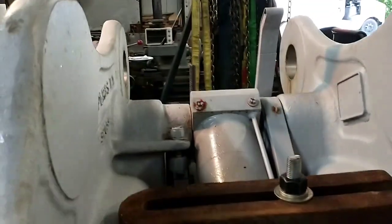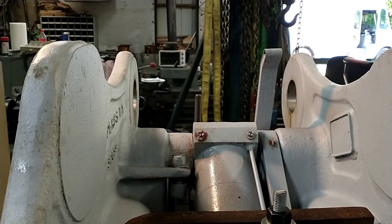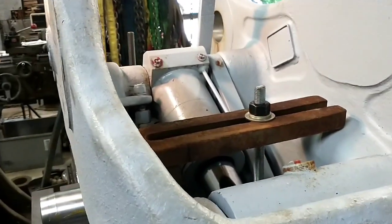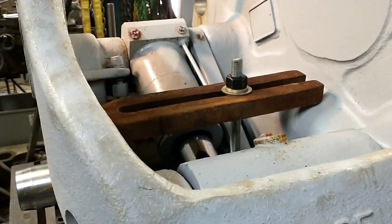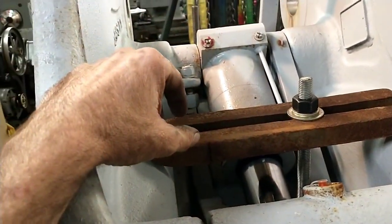Otherwise, I would have to weld that on, bore through it. It's way easier to do the machining on them rings in the lathe and just take them to finished size. So my intention is to bore this to size, slip a pin through with my ring on, slam it up against there, and weld it in place.